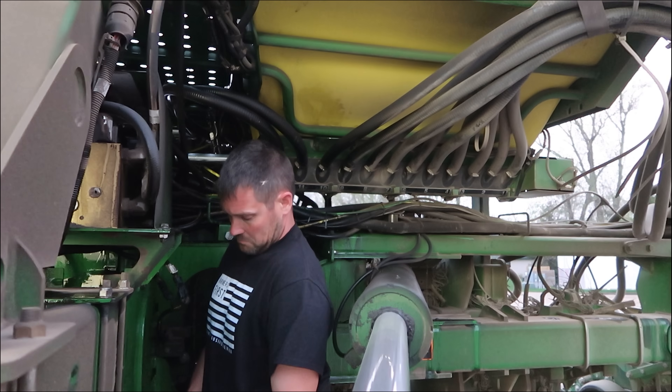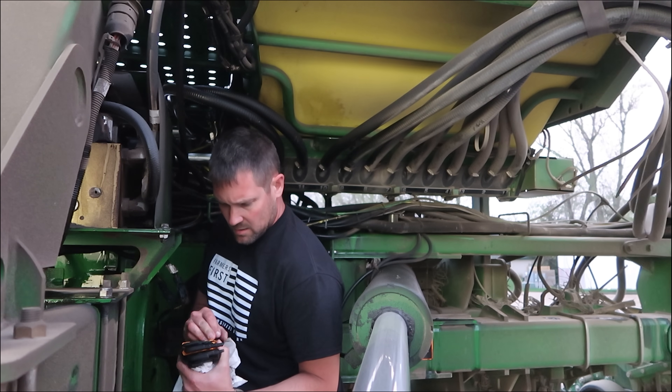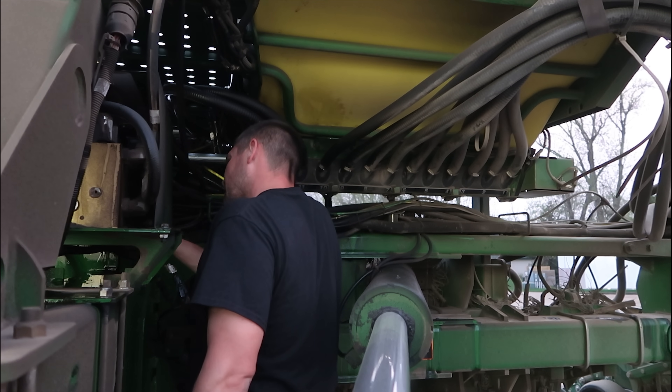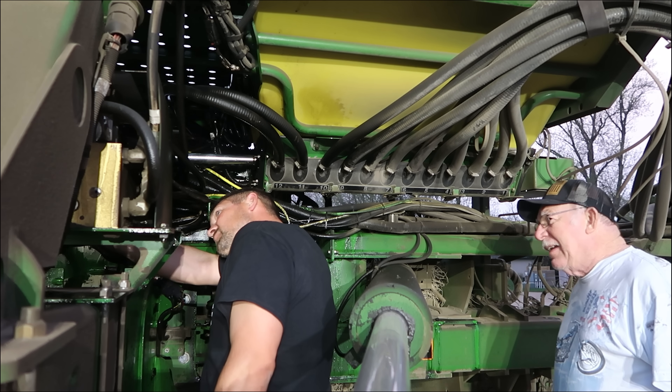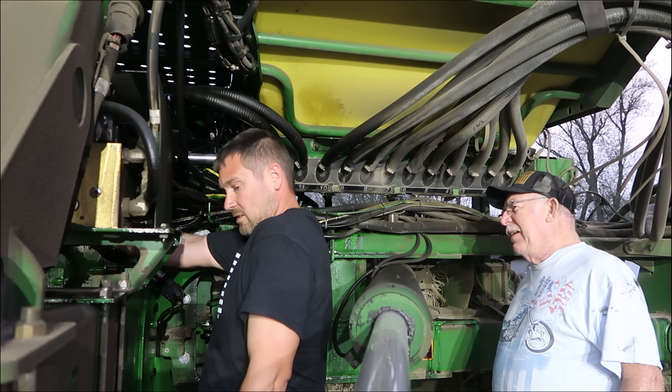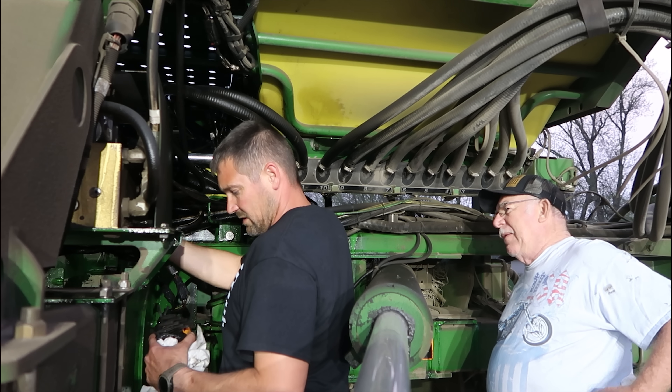It's never good to blow your O-ring. As long as the hydraulics are not on, there's not pressure on that O-ring on that plug. So it's going to be messy either tonight or in the morning. I'd rather be able to go in and change it now. We have a couple O-ring kits — maybe we'll get it back in there. I need all these hoses out of my way — there's about a million of them all in the way. If I can get a wrench on it, I'll never be able to turn it.